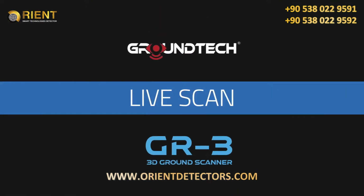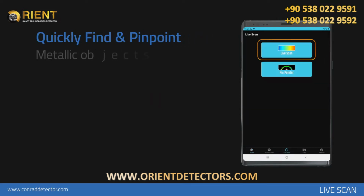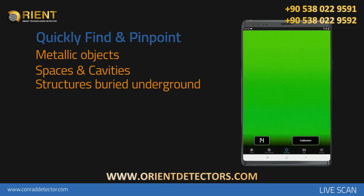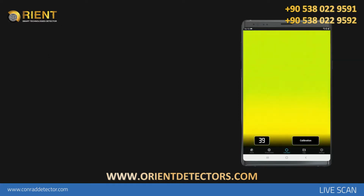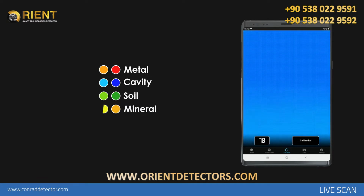Live Scan. Live Scan is a 2D search mode that allows you to quickly pinpoint objects, metallic objects, spaces, and structures buried underground with magnetic effect. In the Live Search Screen, you can see all metallic objects and most objects with high magnetic effect as red, some as orange, cavities, earth fills, caves underground as blue, the earth without any changes and anomalies as green. You can see mineral soils and objects with a relatively low magnetic effect as yellow and orange colors.